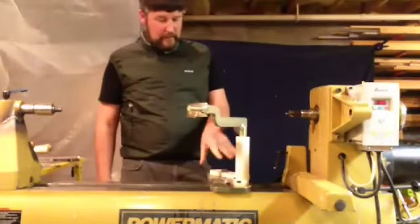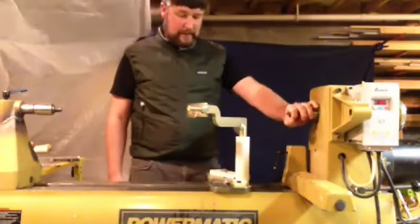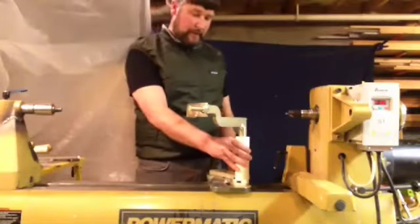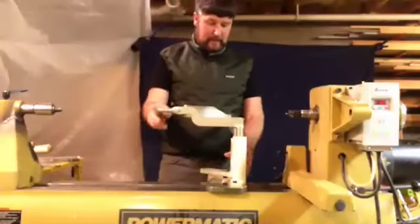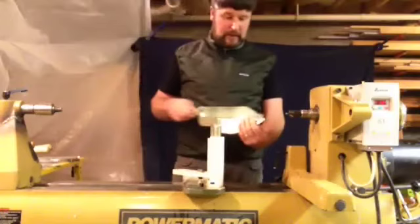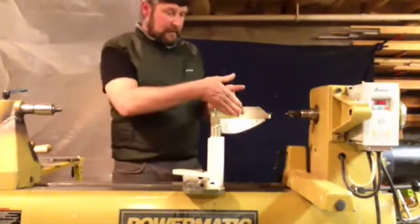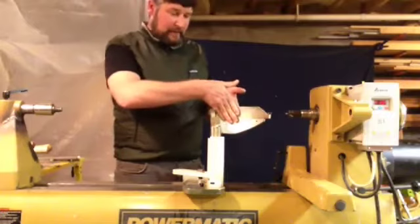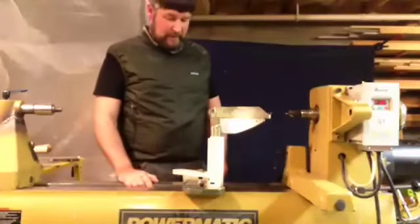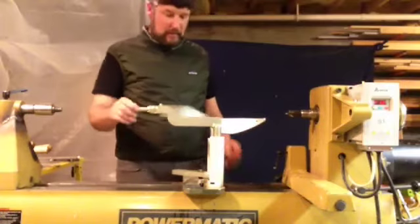The base you get for your lathe, and the posts are determined by the height of your headstock. So this is set up for a 20-inch. You've got a fixed post that you pivot the cutter on, and then you've got an adjustable post that is the support, and it supports the knife as you are plunging it into the bowl doing the cutting. It's a very well-designed system. The knives and the support are the right shape to fit the curvature of the bowl. The limitation is that you're fixed to that curvature. But I think the shape is good, and it's such an easy system to use.